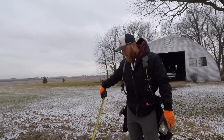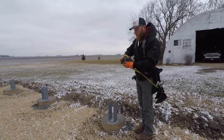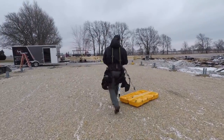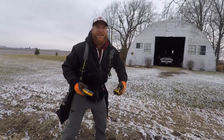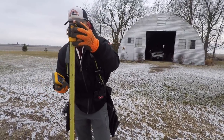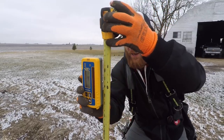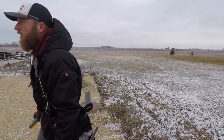The highest pier we find is what we use to determine our benchmark for all the posts, trusses — everything will be based off of wherever the highest post is. We site right down the line to find the high one. We've already determined this one is probably one of the highest. The laser wasn't on — that's on me. What I love about the Spectra laser is it tells me when I'm close and when I'm right there — it's telling me I'm one-tenth of an inch off, and I can find zero really easily.